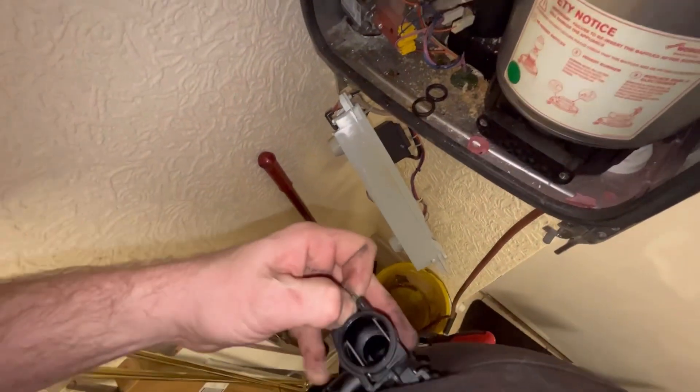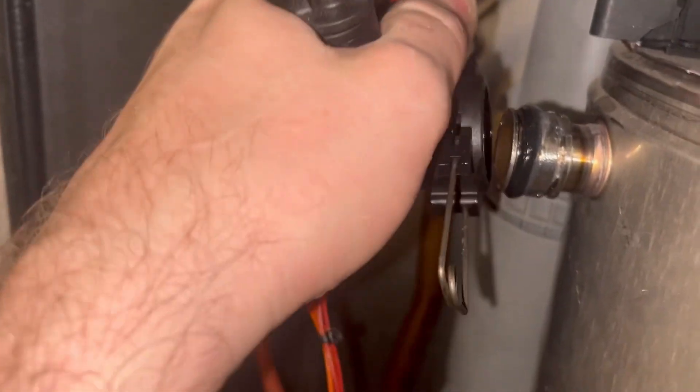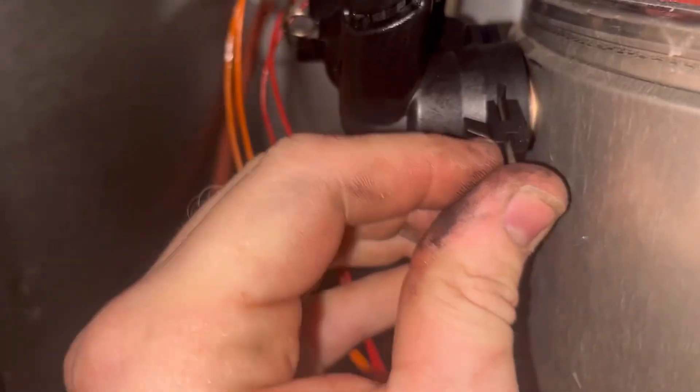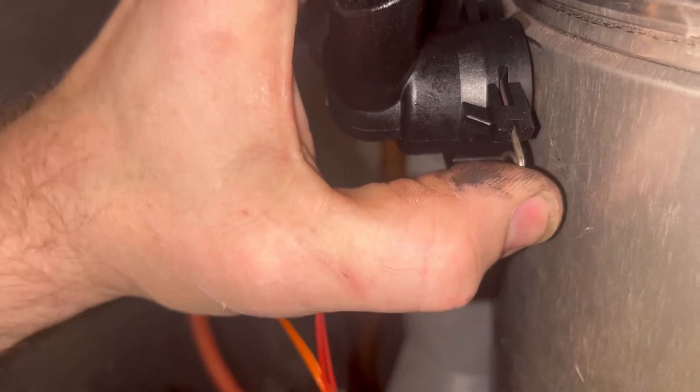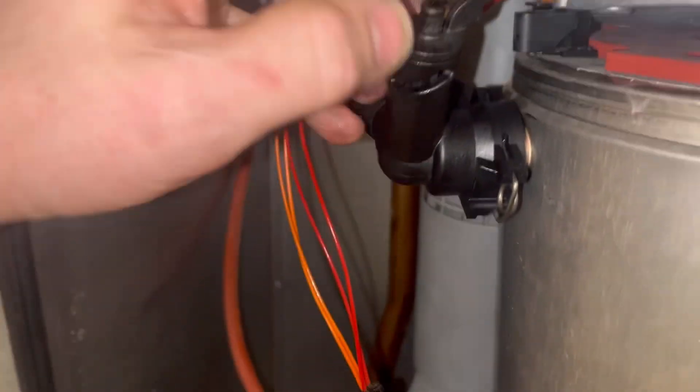Get the O-rings replaced. New O-rings on there with plenty of silicone grease. It does come with the clips. Just pull it on and get it onto the heat exchanger. Give it a pull to make sure it's on, then twist it, push the clip through - it can be a bit tight. That is fully home now. Give it a pull - yeah, that's fully on. Make sure that's closed and that's the flow elbow all done.